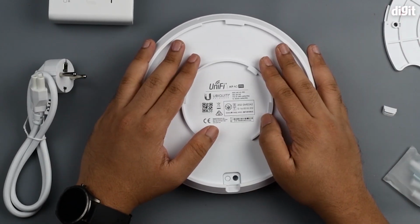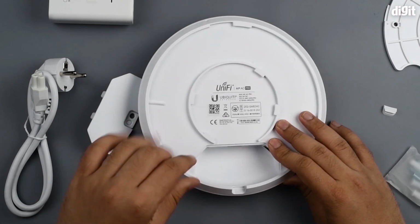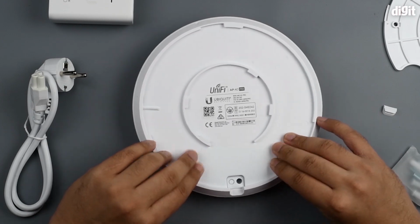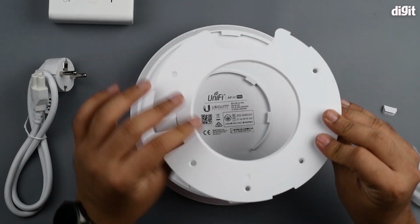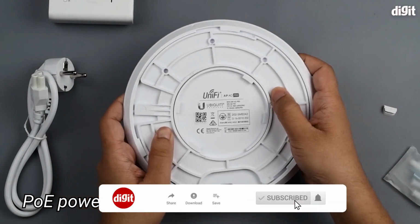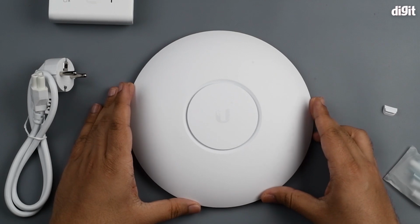Now, if you were to install this outside, then first you would connect the ports to the device. Ideally, you would want to use the PoE option, and then you don't have an option actually. And then you'd cut off this section of the rubber sealer, place it back in, and this will be mounted onto a wall. And then you have a little arrow that tells you that you have to align it to this particular tab on the device. You place it and rotate it into place. So on the outside, it's going to look plain and simple with the Ubiquiti logo pointing straight upwards.